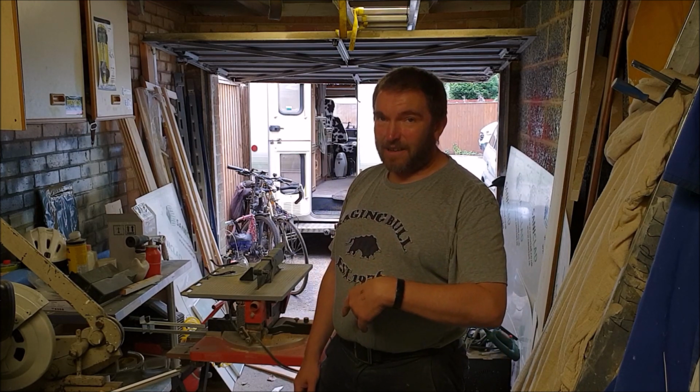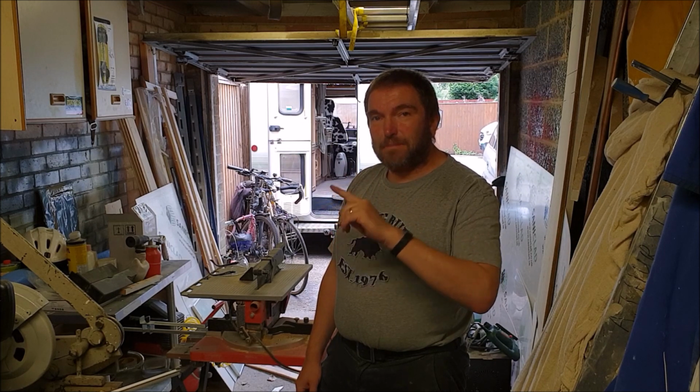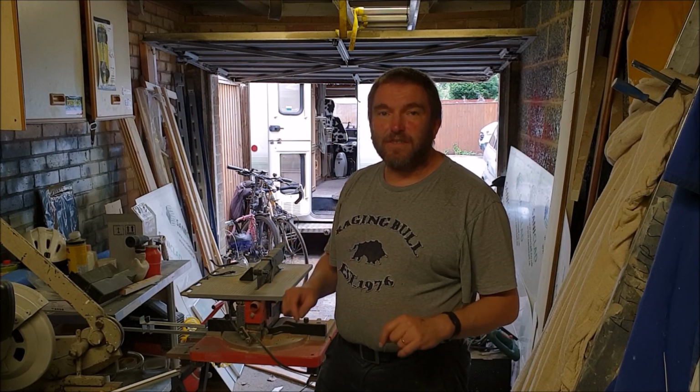Of course, I didn't really have to fix it with every single screw. So I'm going to take the toilet out again, and then we'll fix that back trim, then put the toilet back in again, then we can fix the side trims. And what I'm going to do, instead of having the screws and caps that were on there before, is countersink the screws, and then we can put some of the white cladding over the top of that plywood, just to keep it all looking nice and clean and the same.